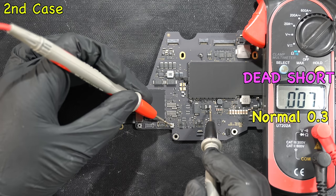Diagnosing the explosion area is puzzling at first — no short to ground is found at the PP3V8_ALWAYS_ON probe point nearby, and a tiny inductor also looks busted. Measuring the SPMU_BSTLQLX pin also shows no short to ground. When something explodes, the cause must be really near, so we poke and measure the surrounding SPMU pins and finally find the troublesome PP5V_BSTLQV_OUT_SPMU rail. The test points are only on the other side of the logic board — measuring the diode value there gives a dead short to ground at 0.004.